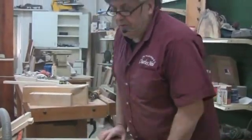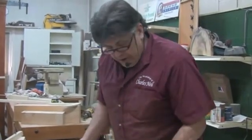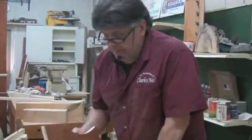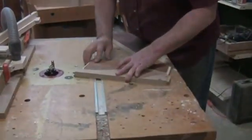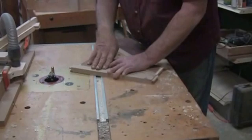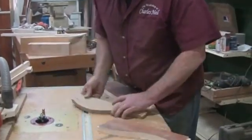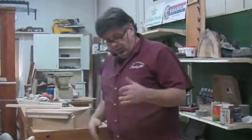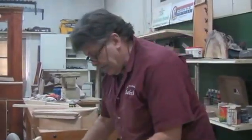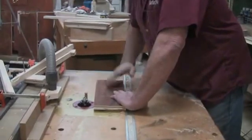If you elect to cut your tenons after you've done your stick, when you're doing this part to cut the tenons, save the off-fall from where you cut it out and use it. Now this is longer, so this is not the exact off-fall, but keep it so that on this end you can go flat. When you do this side, you're already going to have a flat surface. Now here's another thing you can do to handle what we're getting ready to do, and that is to keep yourself wider so that you have something to hold on to. Got that? I'm going to show you that.